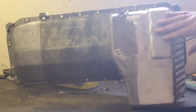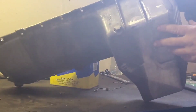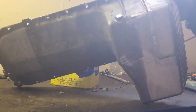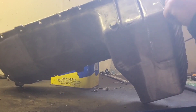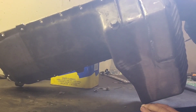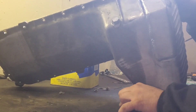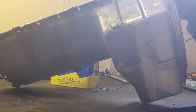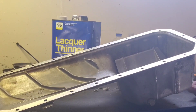As you can see, this guy had a very large puncture wound right in the bottom where it had slammed into something. This is the forward face of it. They went in, took a piece of aluminum, and welded it all around and doctored it up. This thing had previously been doctored up with a whole bunch of JB Weld paste all over it, so the welder probably had a real tough time. With aluminum you can't have any impurities in the metal to get a quality weld. This is old aluminum that's had oil in it its whole life, and then somebody put epoxy JB Weld in it — so I'm not upset about the porosity you can see. I'm sure he had a hell of a time. Hopefully he fluid-tested it and it holds, so she'll be good to go.